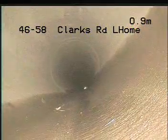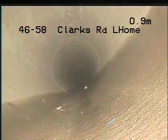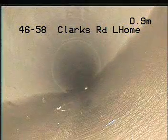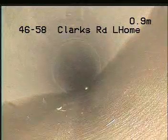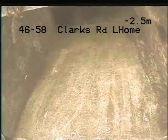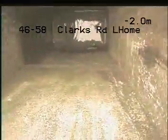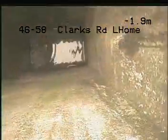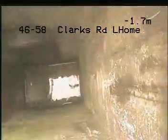You can see there's a fairly decent hoop in the pipe. We're losing the invert, or the top of the line from the invert. We've retrieved the camera back up — you can see it's negative two and a half meters. It's a fairly deep manhole. You can see it down there — you've got the line uphill and the line heading down.